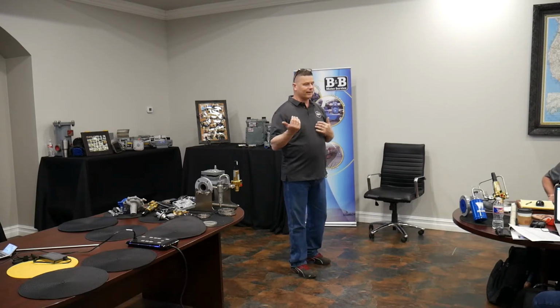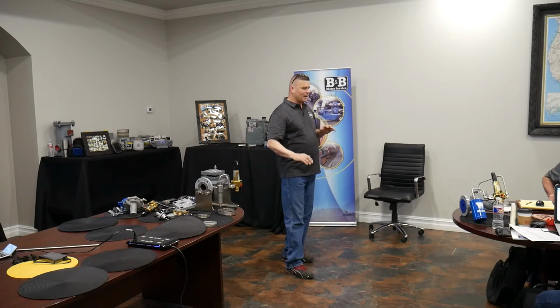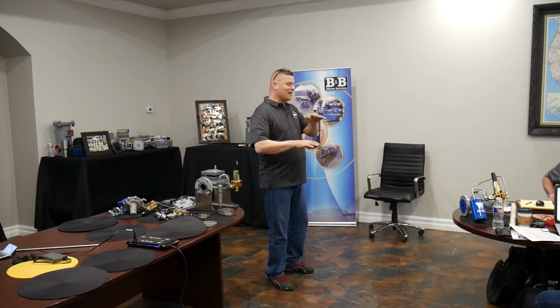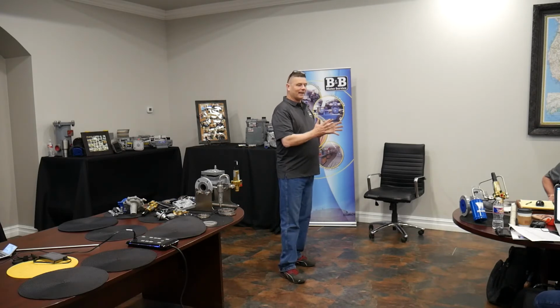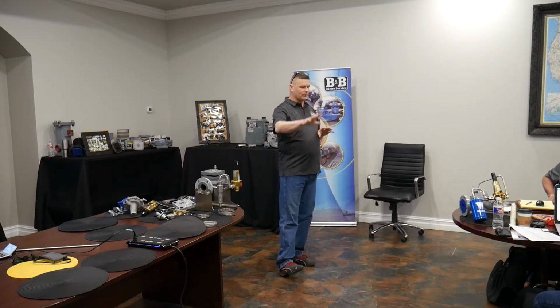If you go into valve spec, it's a catch-22. We're going to soon find here in a minute. Because you're going to want to size for the conditions to find the valve, but you have to have a starting point. You have to plug in some valve to work against that'll either tell you, well, that's too small, or it has this or that issue. So the way that you plug in a decent possible solution is use the simplified gas sizing equation first. Plug in those and then see what that gives you when you put the process conditions against it.